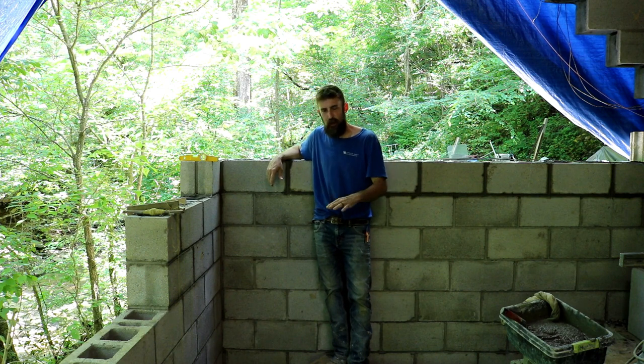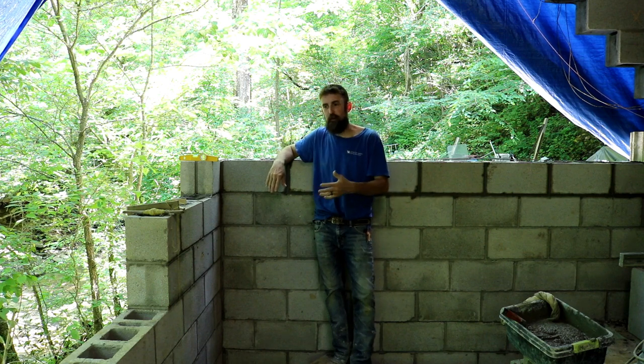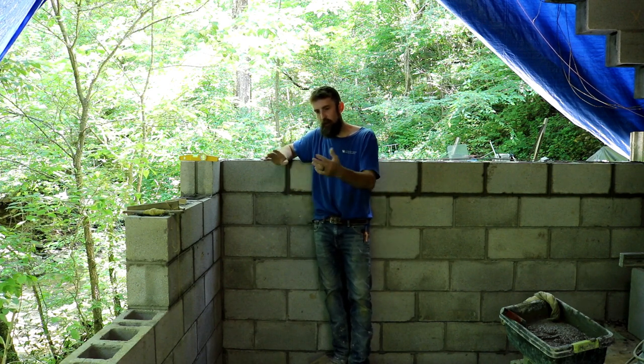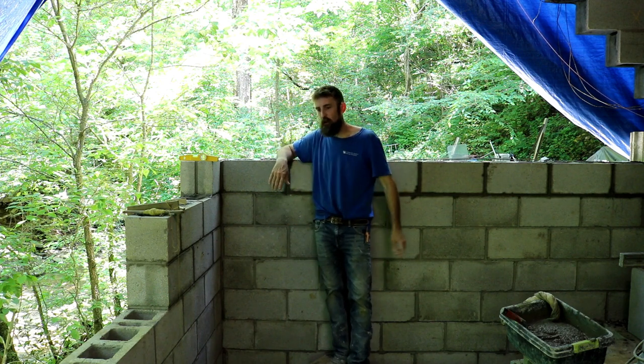Now, this building was falling down. It was a block building built on a slab, just a concrete pad that was poured, and then a block building built on top of it, close to a hillside. So, recipe for disaster. No gutters. Washing out, erosion, the building lost support and broke and failed. This floor was tilted about 5 degrees and this wall was falling.